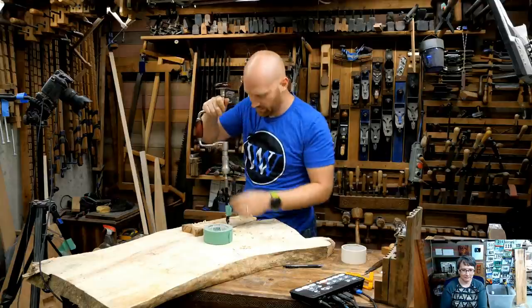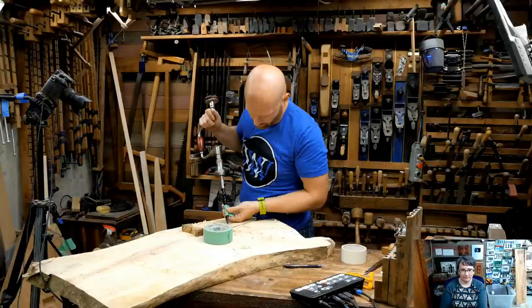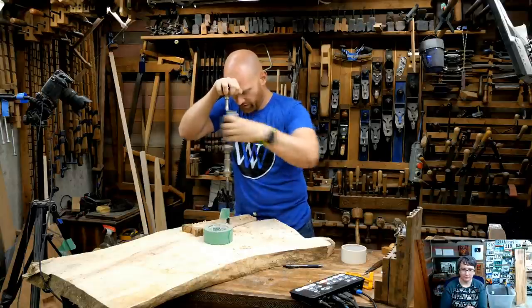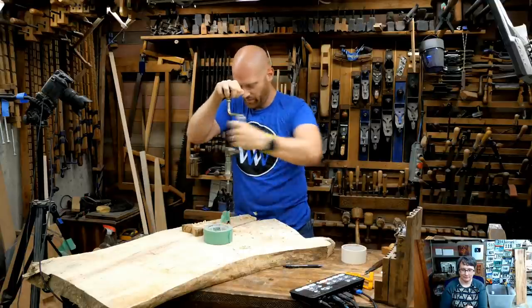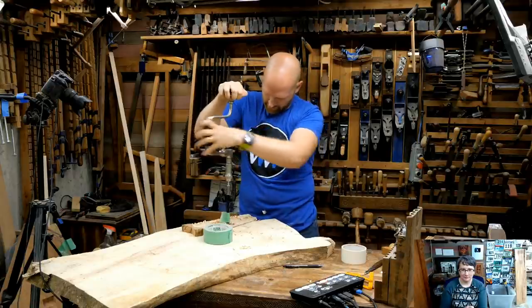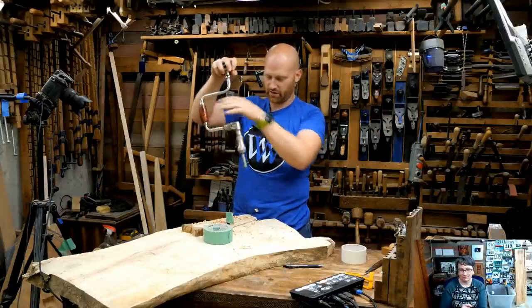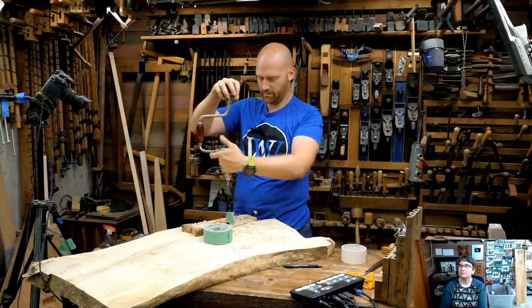And surprisingly, this brace has more torque than the biggest battery-powered drill you have, because with your biggest battery-powered drill, the torque is determined by how far your hand is away from the spin. And so you can only have as much torque as your hand can force. And because in this, your hand is farther away from center, you can actually get more torque on it. Oops, it flipped out. Helps if I tighten that down a bit. Here we go.